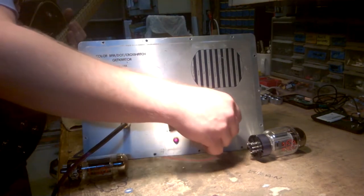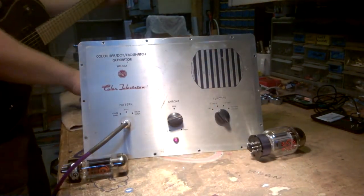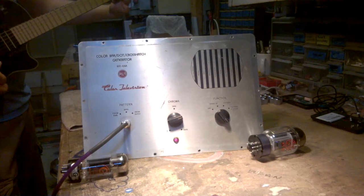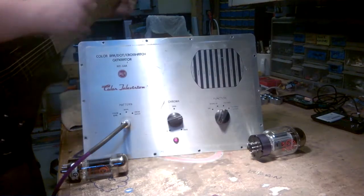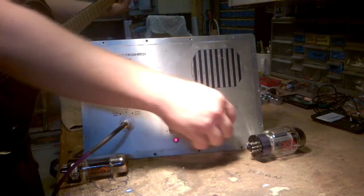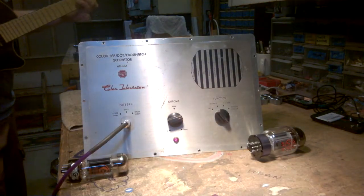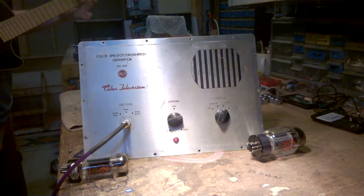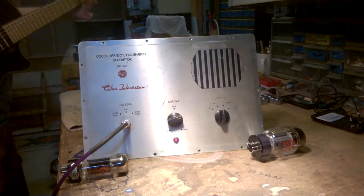What this will do is give you the ability to control how much negative feedback you have in your circuit. I have this one set up so it goes to zero — I can turn off negative feedback completely and it'll have more of that open sound like the Fender Vibrolux has. On the exact opposite end of the spectrum, I like this amp with that function because for recording I have more control over my sound. On certain parts of a song I may want a nice tight, defined tone.